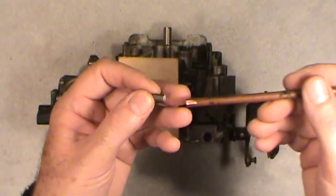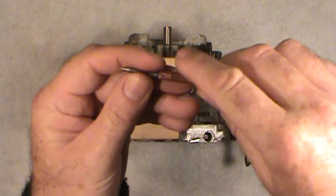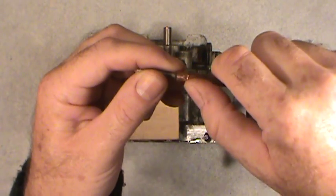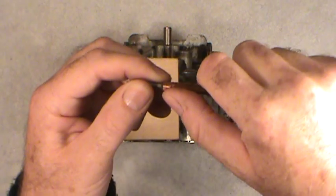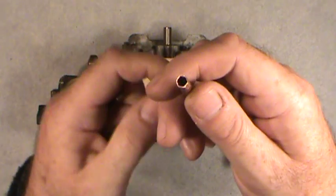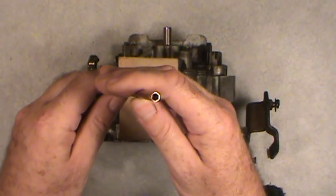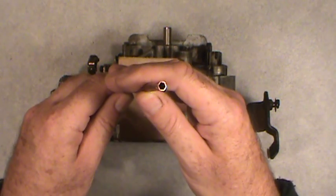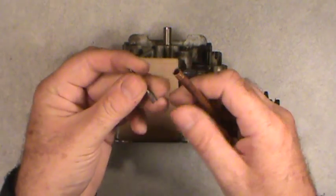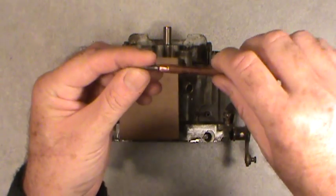So what I did was made it even better. I put the tubing on the end there — it was a snug fit — and I just rotated it three times, kept squishing this copper, and copper is fairly soft. So I actually made my own socket, so to speak. If I can hold it still enough, I can actually show you what's happened — I filed it so it would shine a bit, and you can see there's a hexagonal shape there, much like a socket. I can probably tighten the fit up later, but just for today's video I just decided to do that.